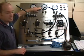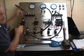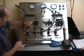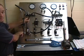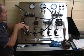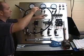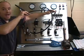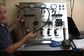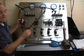What you'll notice is the pressure line from the pressure manifold is going to run into the left side number 1 here at the bottom — the number 1 is stamped on the side. The number 2 hose, the one at the top, always has to return to the return manifold. It always has to send that oil back to tank. The number 1 on the right-hand side should supply pressure and flow to whatever is actually accomplishing work.